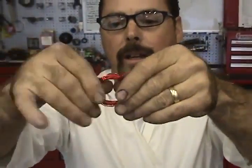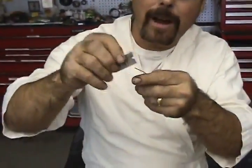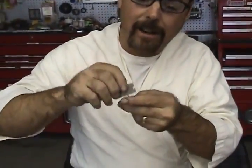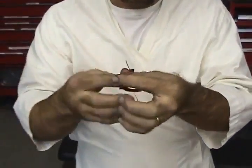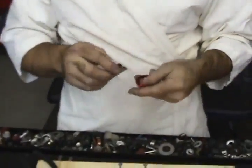You want to get that wire towards the center as much as you possibly can — just like that — so that way it creates balance when it goes to turn. Now, if you've got a razor blade, you're going to want to scrape off all that insulation. Watch your finger — you don't want to cut it off. On the other side, take it all off except for one side — leave one side insulated. There's a reason for that: it'll shut the circuit on and off.